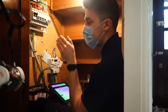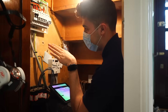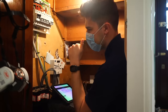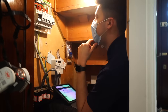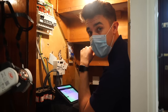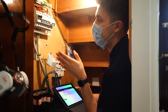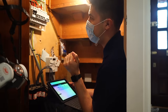So what I've suggested to the client, which the client's happy with, is we're not going to do any work today. So we're just going to go home. No, we're going to do work today, but we're not going to do any install. So forget the consumer unit change, the car charger install, all the rest of it. Today is just going to be an EICR all day, because I've only started on one circuit so far, and we found all of them faults out there. And that was just doing a quick visual inspection. So I'm going to do a really, really thorough EICR. I'm going to take pictures of everything that I find, and just go from there.